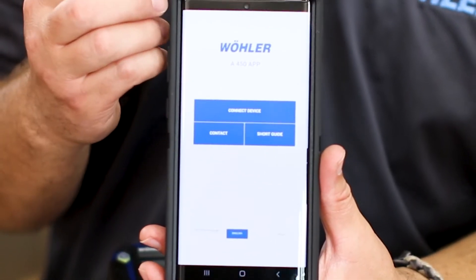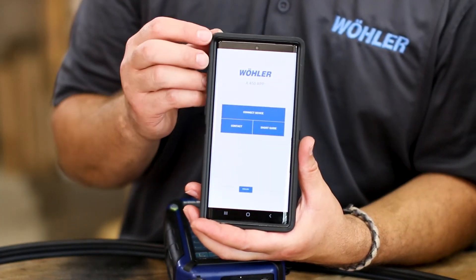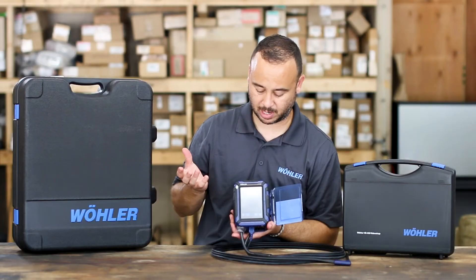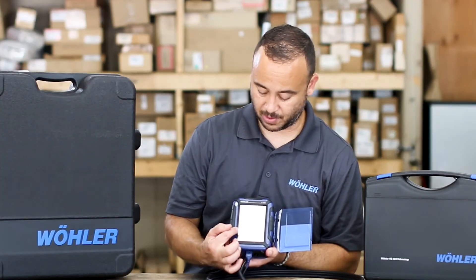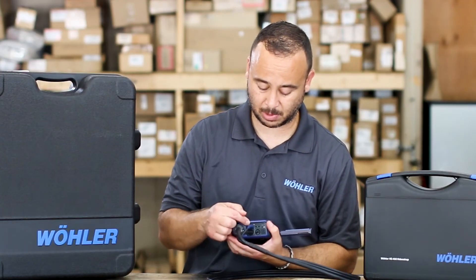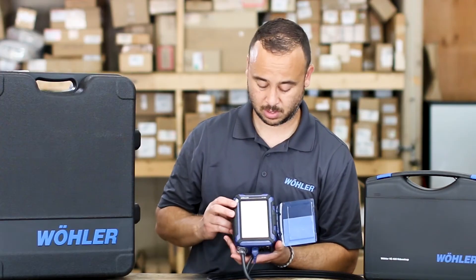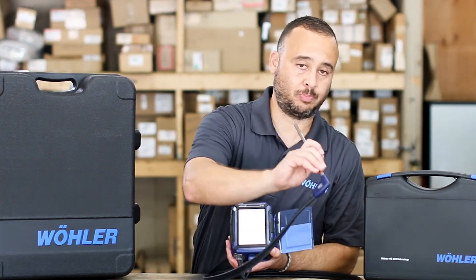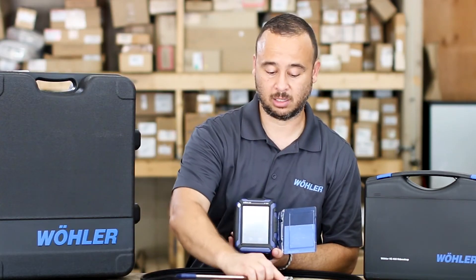Here's a quick glimpse of the A450 application on an Android system. Simply follow the prompt to connect it to the Wi-Fi configuration with your system. Once connected, you can view live graphing and live information on the phone. Press the manifold pressure test and it'll begin to graph once you have a hose hooked up reading vacuum or lack thereof. At the very bottom you'll notice the TA reading, which is the ambient temperature reading. You can hook in a K-type clip on the bottom for an external temperature probe, offered as an option in upgrade kits or as a standalone accessory. The top side shows your stack temperature, and that probe is located inside the gas probe itself in a bi-metal configuration that sends a signal to the unit and displays temperature on screen.